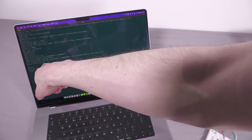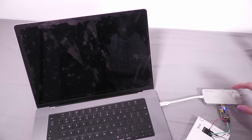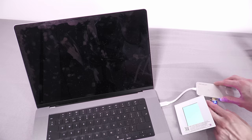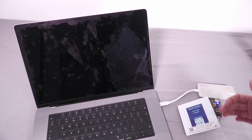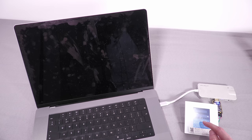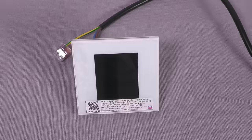That's it done — it's put the firmware out, verified the hash, and reset the device. It'll just be sitting on the white screen because of the IO pin short to ground, but all we need to do is disconnect the USB, remove the short, and power up from USB to test it. Plugging that in, in theory this should boot into OpenHasp — and there we go, that's OpenHasp starting up! It's now saying setup Wi-Fi, and it was broadcasting an SSID so you can connect to the access point from your phone or tap on the screen to enter your SSID and password on a tiny on-screen keyboard.